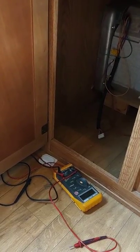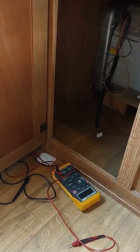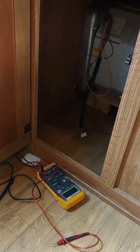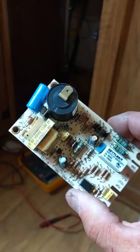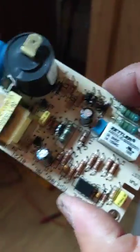So I checked everything out. I know my gas was good, but it turns out that I wasn't getting power to the gas regulator, the gas valve. The fuses were good, everything was good. So I went inside the water heater, pulled out the circuit board, looked it over — everything looked good, none of the contacts were swollen.